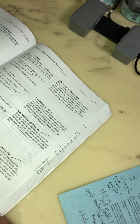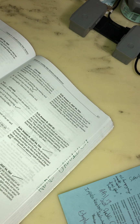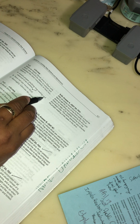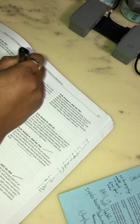In shock struts, chevron seals are used to prevent oil from escaping. When an empty shock strut is filled with fluid, care should be taken to extend and compress the strut completely at least 2 times to ensure proper packing seat ring seating and removal of air bubbles.